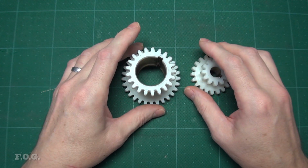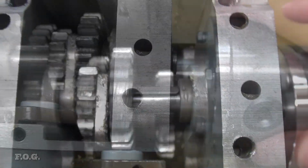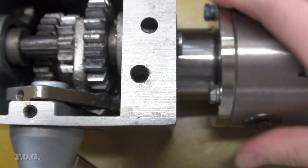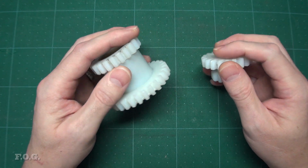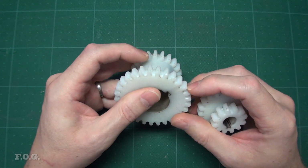After completing the gear installation, I found the low gear ran pretty good, but the high gear was generally pretty tight and would effectively even lock up in certain locations. So that's not a good situation to have. To fix this, I ended up spending a good part of the day trying to identify the problematic teeth and filing them down until I could achieve a somewhat free spin.